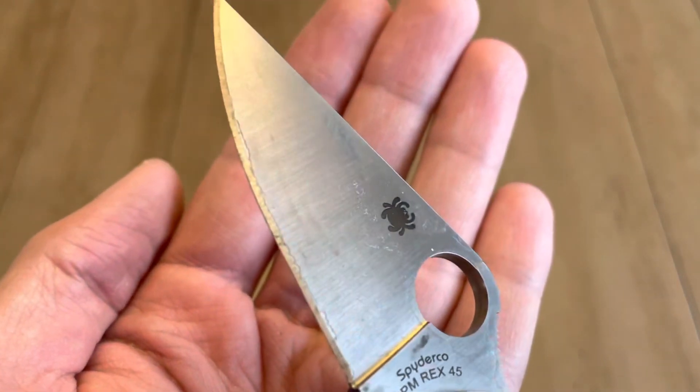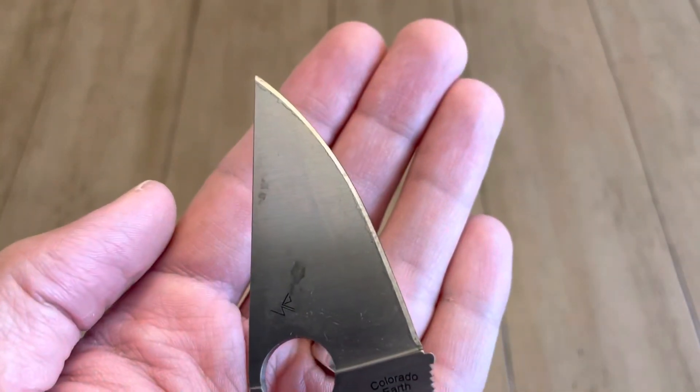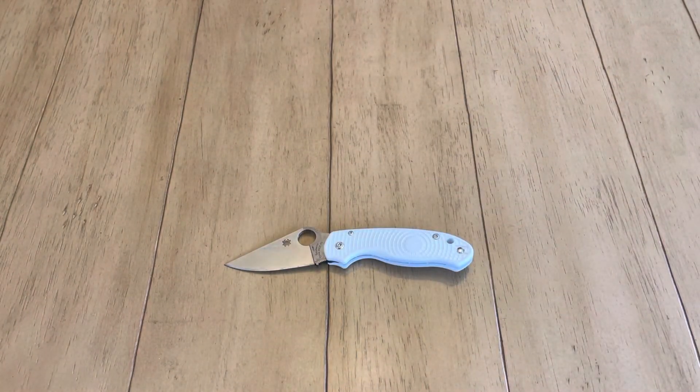Remember, before you apply anything or soak it in vinegar, make sure to put nail polish on the blade edge on both sides — you can see the line where it was — and also put it around the pivot and the detent track. That's just my take on the patina process and some tips if you guys want to do it. Really, there's not a wrong way to do it — just be careful not to let water become a factor, because then you'll start getting red rust, which you do not want. Choose something fairly acidic and go from there. Feel free to leave questions in the comments, leave a like if you enjoyed the video, subscribe to my channel, and we'll look forward to talking to you guys on the next one.